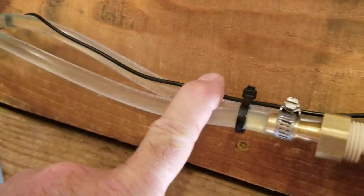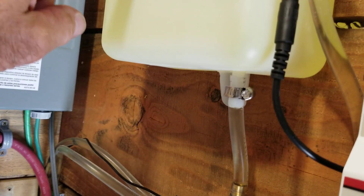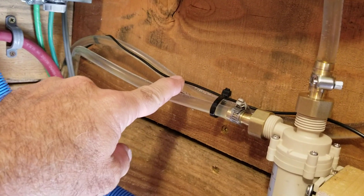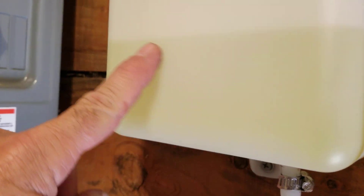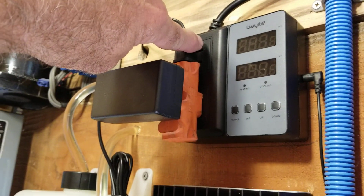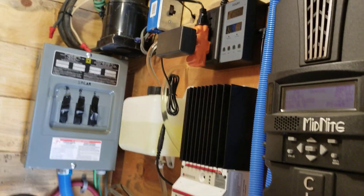For the winter heating side, there's a little bypass between these two lines — two valves open, one valve closed. I put a small aquarium heater in this tank, and when you open one valve and close the other it bypasses the radiator loop and circulates heated coolant from that heating element through the batteries. That's what that upper port is for right there. You can adjust up to a 25-degree bandwidth with that.